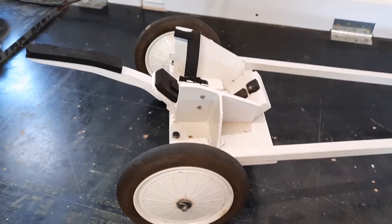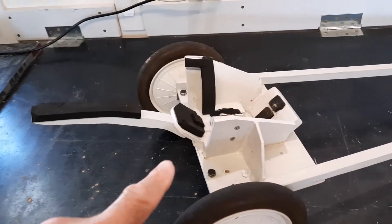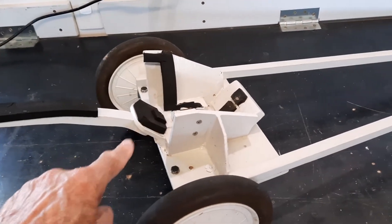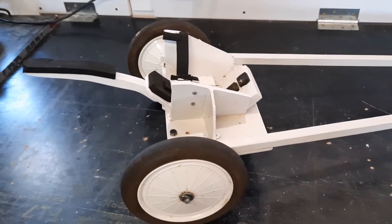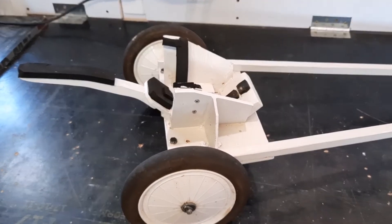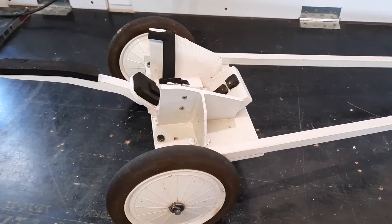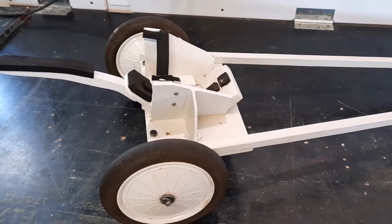During development you'll notice this pad here — the original — was just to stop the aircraft tipping forward and also to help push the dolly along. We found that if you open the throttle too quickly it would tend to nose over and the prop would touch the grass.